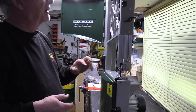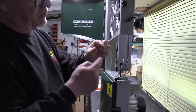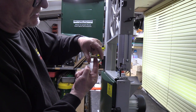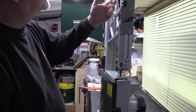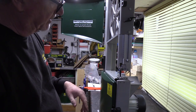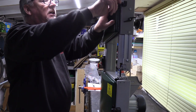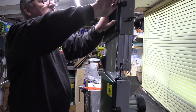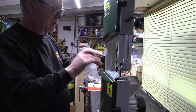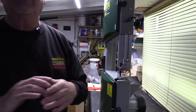Don't get hung up by a measurement or anything else like that. Each band wheel has got a tyre on there, and it's got a crown to the top of the tyre, so we're approximately putting the blade in the centre — we don't have to do it to a measurement. What we don't want is the teeth forward. Be careful with the smaller blades as well — get those set up nicely. Same with any of the blades really, just take your time and it should have a nice clean setup. So that's a little bit of an introduction to putting a blade on, doing your tracking, and then doing your guides. On the next one I shall introduce the table, setting the table up, and going through the bits and pieces that come with the machine. Catch you on the next one — cheers, see you soon.